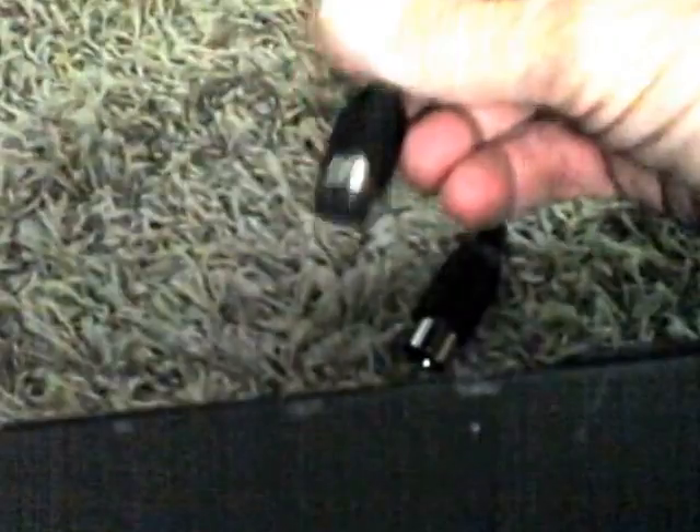Next step: make sure your USB is connected. There's a Roland UM1, so it's clearly marked. This one says connect to in and this one says connect to out. Some of them will just say in or out — it'll be backwards. If it says out, that goes to the in. And if it says in, that goes to the out port. It's not logical, but in goes to the out of the one — that's basically out from one to the in on the other. Make sure it's connected to USB.